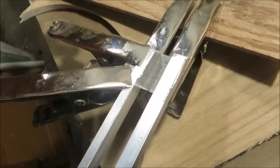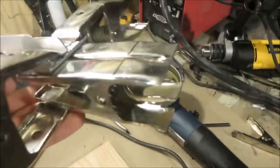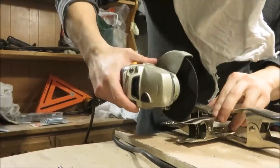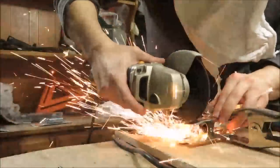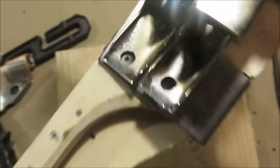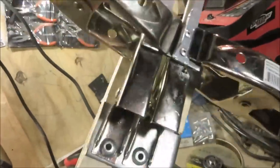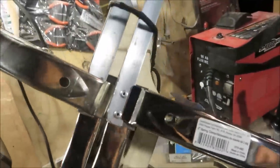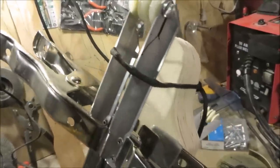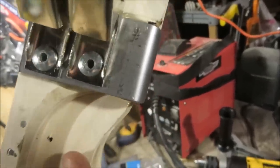I put these two clamps side by side and hooked up that whole arrangement to the clamps and the piece of steel I just cut out. Clamp this together, then I'm going to drill the two holes for the eighth-inch rivets, and once I've got those drilled and riveted, I'll do the same thing on the other side. Then on these dots we're going to drill some one-inch holes. Take a Sharpie and mark out where you're going to drill one of your holes on the body of the gun. Once you've got one riveted, drill through and pop the other one. Take up the big clamps — you want to do both at the same time so the little clamps don't end up bending the aluminum limbs. I just tied a piece of string around the body of the crossbow around the limb, and from here you should just be able to take the clamps right off. Because of the extra space from not being able to fit that third clamp, I'm going to drill through here and use it to put some screws in just in case the epoxy isn't able to hold that metal piece on.